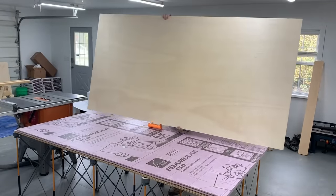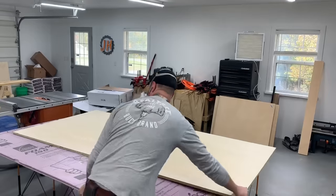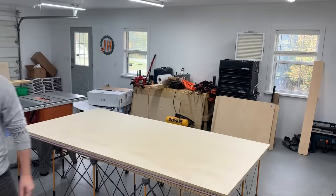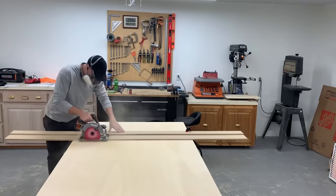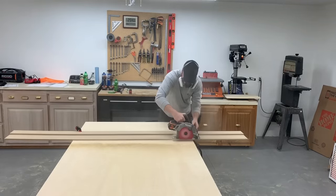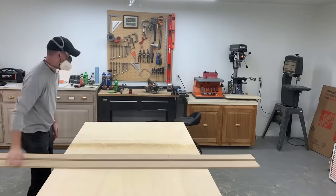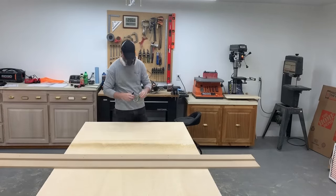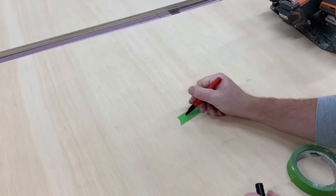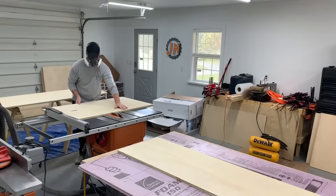There's a wide range of different vanity heights, but I'm cutting my side pieces at 33.5 inches tall so when I add the 2-inch thick top they're a final height of 35.5 inches. I'm making one vanity 36 inches wide and the other 48. The carcass is 20.5 inches deep, and after I add the 3/4 inch face frame there will be about a 3/4 inch overhang all the way around. This would all just depend on the size of countertop you want and personal preference.